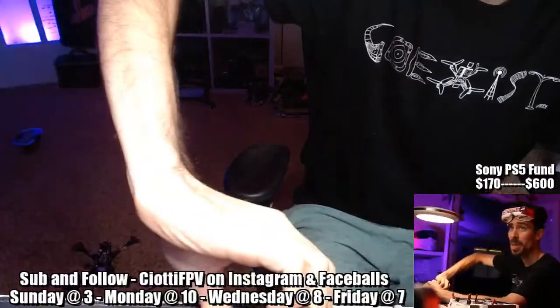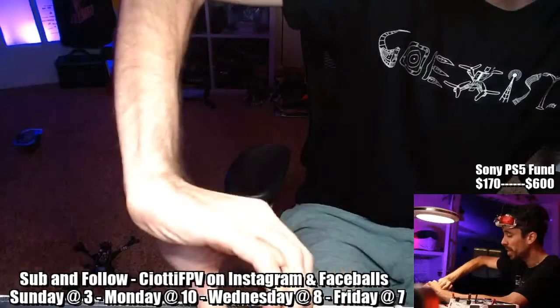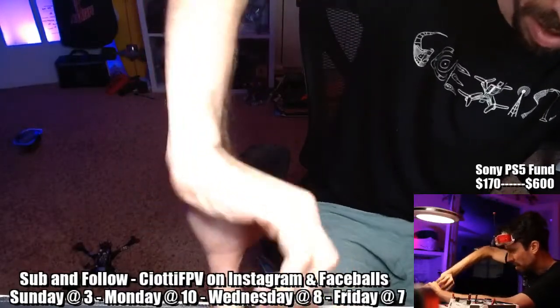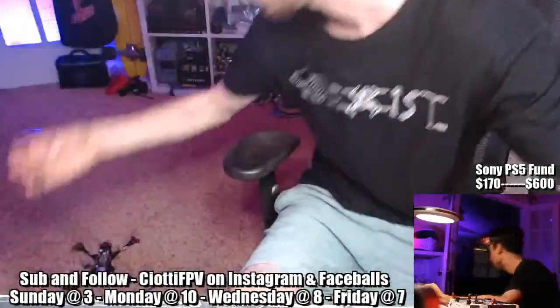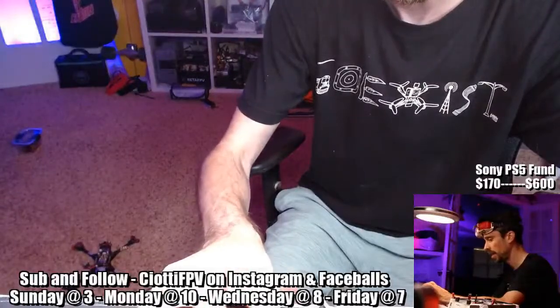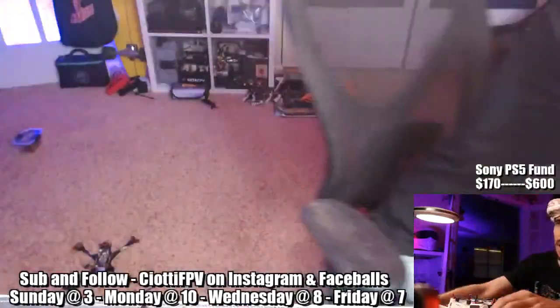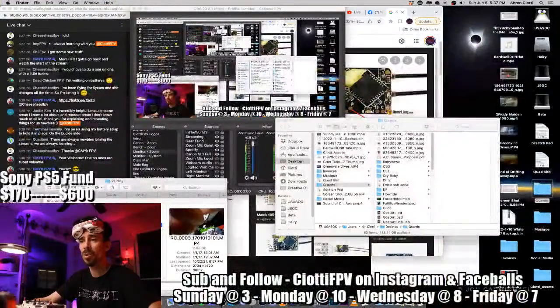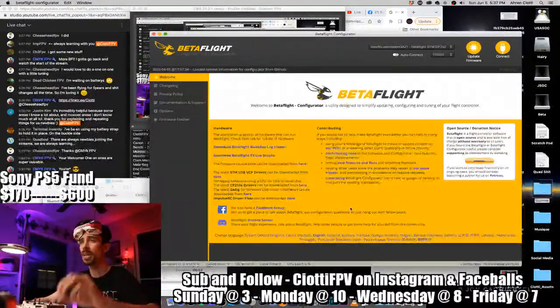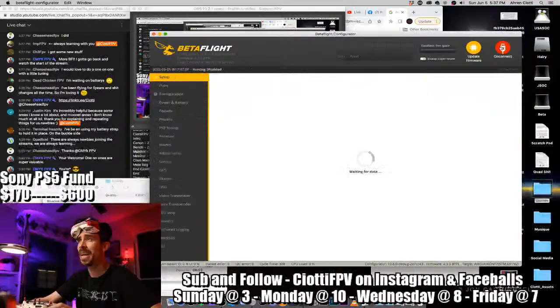So here's the ESC beeper. It's been plugged in for 2 minutes and the ESC hasn't gotten any commands, so it's beeping and saying, hey, I'm getting hot, come back. I'm gonna get LQ out of the OSD because LQ is going to take over the warnings and flash the LQ warning constantly, and I won't be able to get any other warnings.